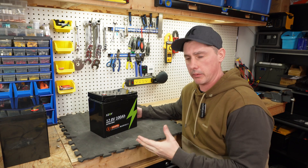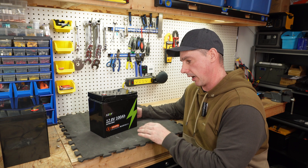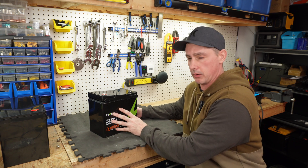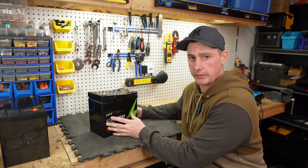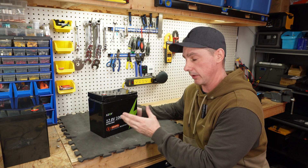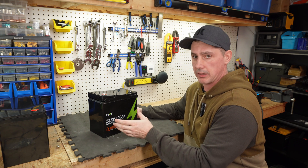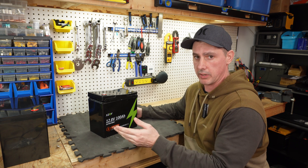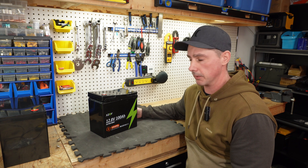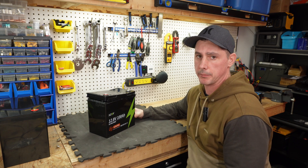With this battery past the capacity test, we do have high temperature protection, but unfortunately it does not have low temperature protection. Brad put it in a cooler overnight to freeze it and then charged it, and it did take a charge — confirming no low temperature protection. For $300, the Ultra Mini delivers the full amp hours. As long as you set up your own protection in your system, you'll be fine — you just don't want to charge below freezing. That's going to wrap it up for this video. Thanks for watching, bye.